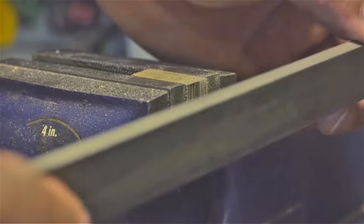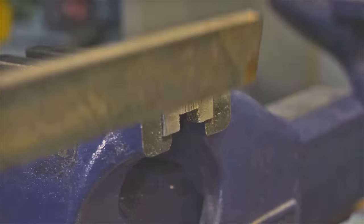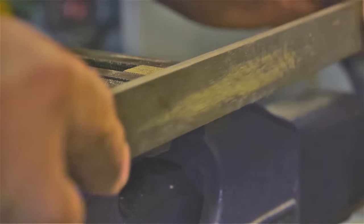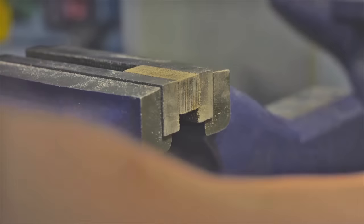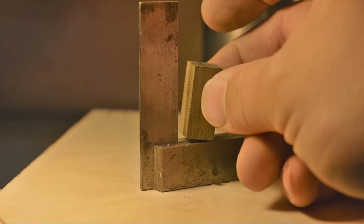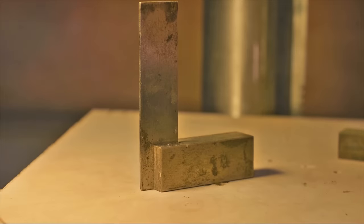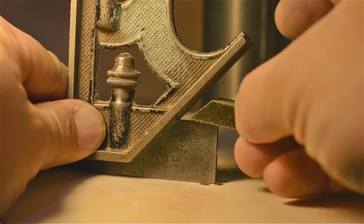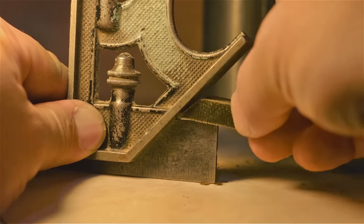For dressing the blocks, I don't use any fancy jigs. Just throw the blocks in a vise and file them square. The 45 degree blocks can be kind of a pain in the butt. Because I'm filing freehand, I do actually check each block for 90 degrees. The 45 degree ones are even more of a pain in the butt, but it's got to be done.